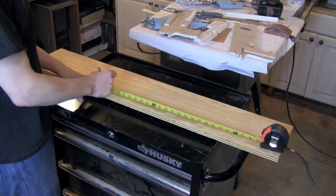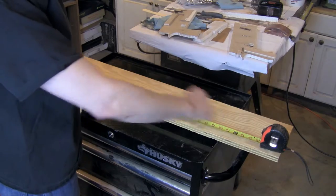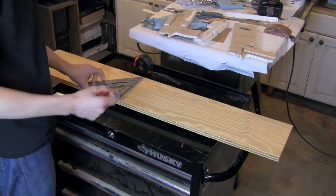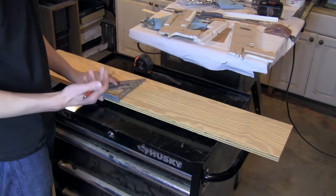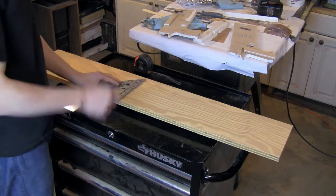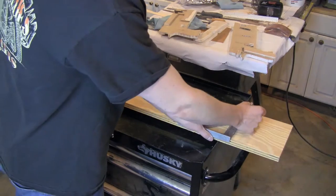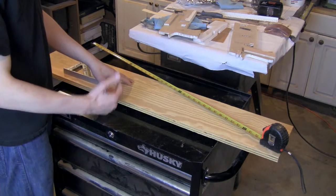Measure it out — if you want 16 inch legs, mark out your 16, mark out another 16 for the other side, and then mark out the length of your shelf. Use a speed square to get right angles. This doesn't matter much even if it's a little wobbly, you're not going to notice — but I like to always observe best practices. Use a speed square and mark that straight line so you know exactly where to cut. Mark it at your other leg too, and you'll cut at least a halfway decent line even if the saw wavers.